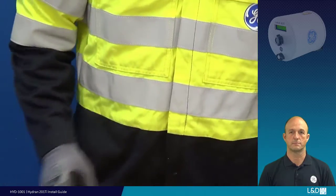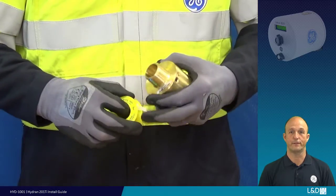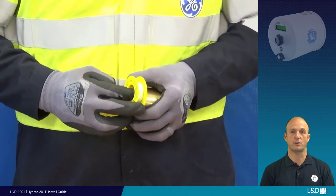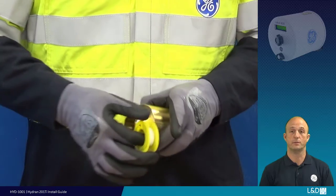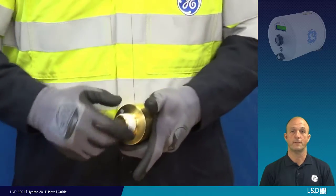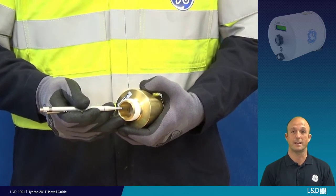Next, wrap the heat fin adapter — again ensuring no tape covers the first thread. Lastly, prepare the sensor. Always ensure the tape is sufficiently tight to clearly identify the thread profile and not over the first thread. Wrap three to five turns across the whole thread length in the direction of the thread — this is clockwise as shown. Pull to break the tape and smooth down any loose ends, ensuring no tape is overlapping the first thread, therefore reducing the opportunity of tape going inside the transformer. If the sensor is removed from the unit for a prolonged length of time, use the protective caps supplied in the install kit to maintain good equipment hygiene.